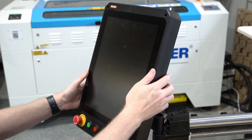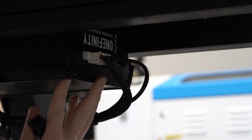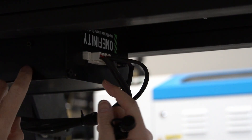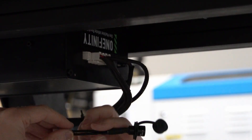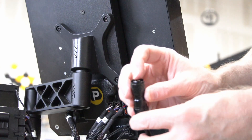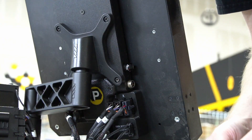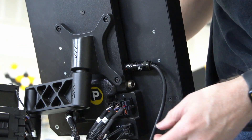Now we've got that section done, let's take a look at our power. Down here on the bottom we've got our power box. You should find a spare white Molex connector, and that's exactly where this guy goes into — just plug that in right there. Here is our power connector. Plug that in, ready to go, and let's plug it into the machine. The six-pin cable — plug that right in there. You'll find the little red dot on there. Get that plugged right in, and now we're ready to start playing with our rotary.